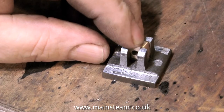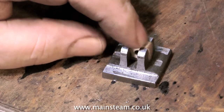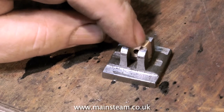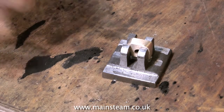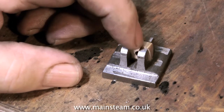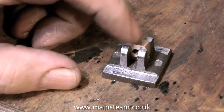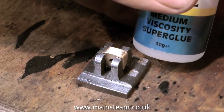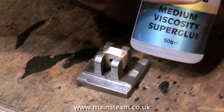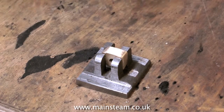With a collector's engine which is going to be largely run on compressed air and usually nowhere near the real pressure required, it is impossible to get the valves to slam back on the port face, so just for convenience this is a good idea. Normally I would machine the valve or the brass part and recess the silicone rubber into it. Another simple way of holding the silicone rubber in place is to use a dab of medium viscosity super glue. Thanks for watching and I hope you found it useful.